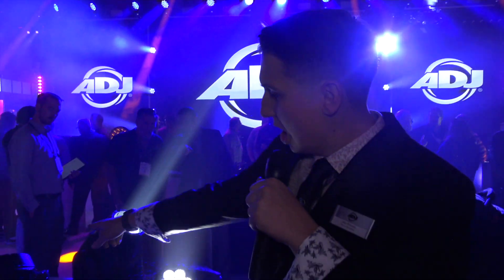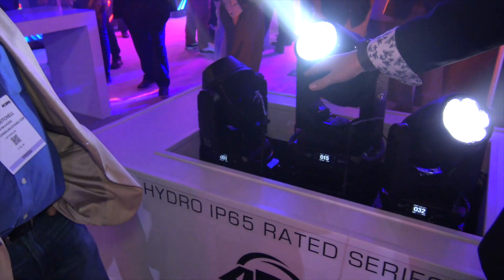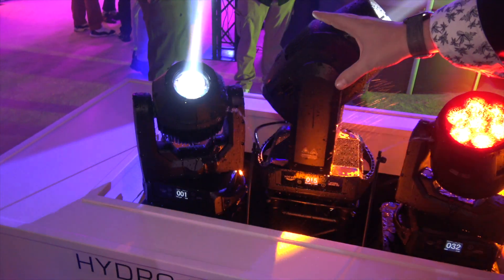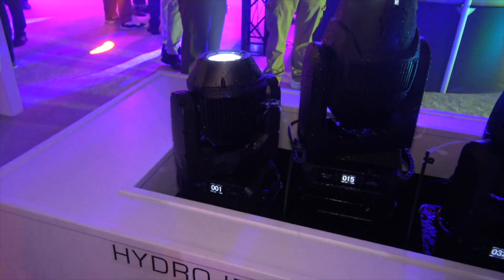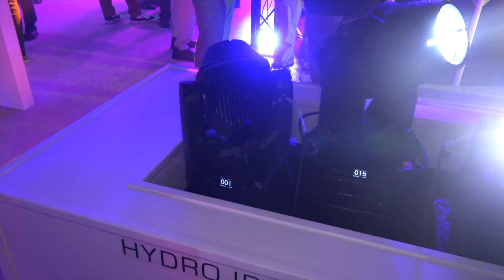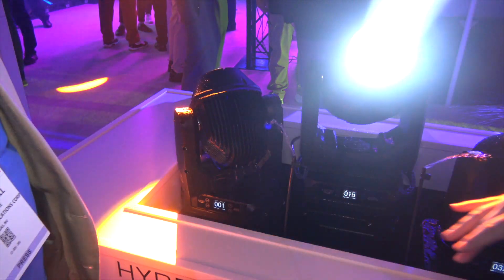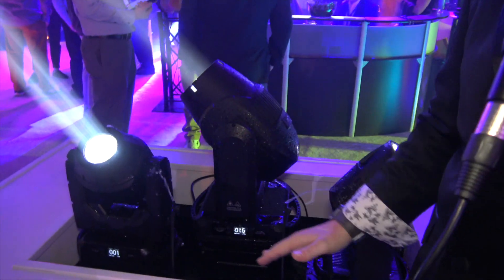On the left here we have our Hydrobeam X1. This is an Osram 100 watt discharge lamp — it's essentially a beam fixture, but you get some other bonuses in there as well. Based on the Osram 100 watt, you get 16-facet circular prisms, metal stamp gobos, a color wheel, and a frost for some washes as well. Again, fully IP65, and one thing that's actually different from all the rest: there are no fans in this head — the whole head is actually a heat sink, so there are no exterior fans.